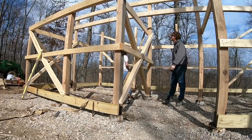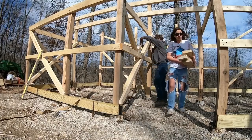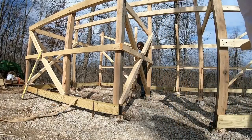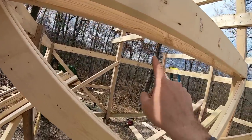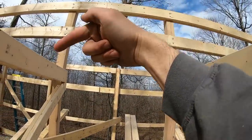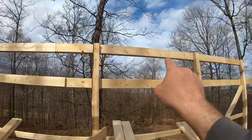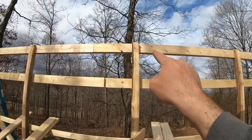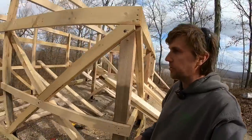It's nice to not have those pieces there for one. Then I don't have to bend everywhere. We've got this cross brace on here. We've got these here, which will be for the roof section right here. We'll do that here in a little bit. And then we've got that all cut to the length it needs to be with the doubled up 2x6 on top, ready for rafters. So that's what we're gonna do. We're gonna start putting some rafters up.